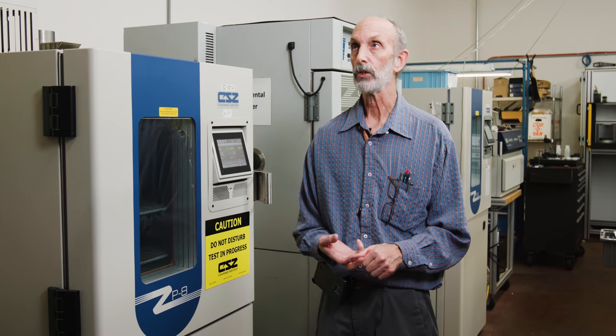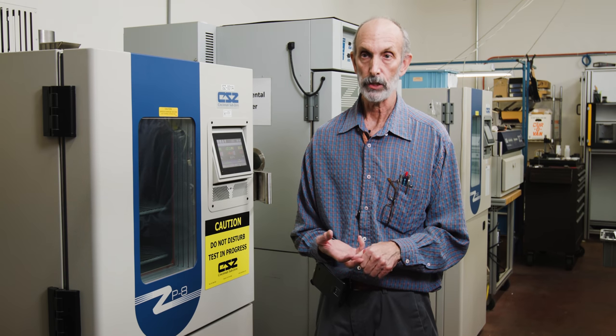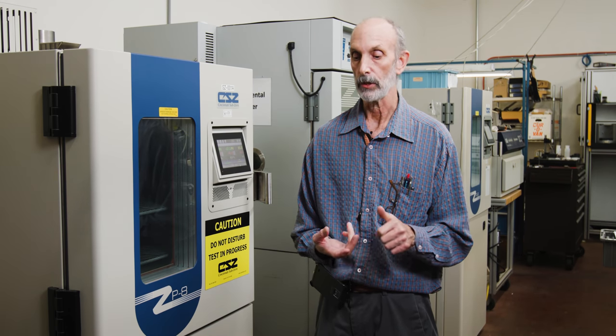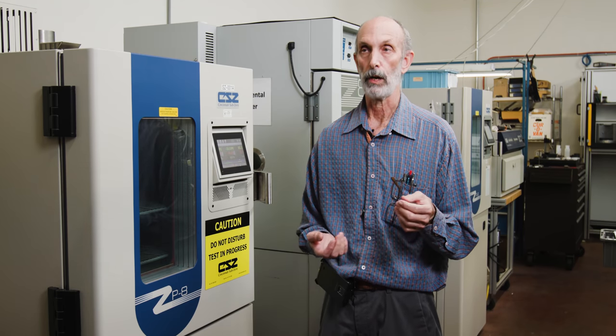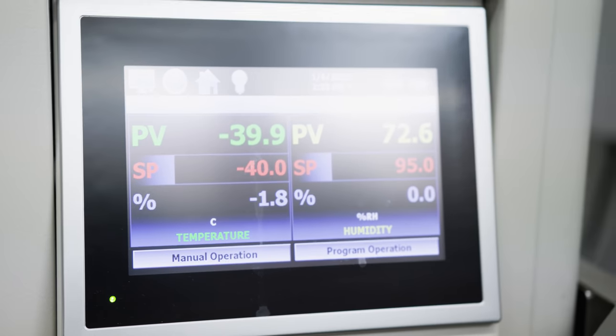Here in the environmental lab, we take a number of tests on our lights. The initial one is an immersion where the flashlight itself is raised to 27 degrees above water temperature — that's a 30-minute test. Once it comes out, they go into an environmental chamber where they are subjected to a high-temperature rolling cycle, and then a low-temperature cycle — very low temperature from minus 51 degrees C back up to normal temperature, and then back down to minus 30 degrees C.